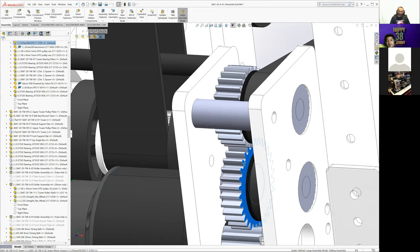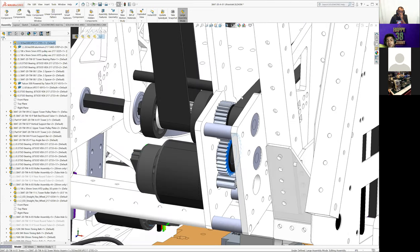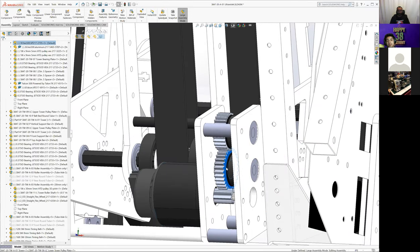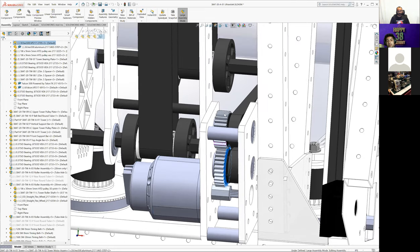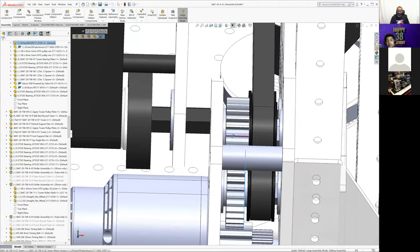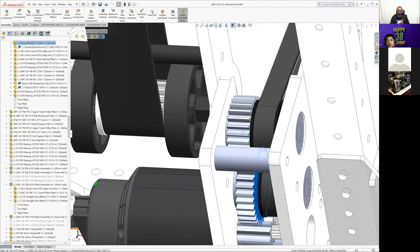But it ended up working, but it is a little odd and probably not ideal that our front belt is going faster than our back, right? Yes. Right, because our back belt is 8 to 30 and our front belt is 8 to 28, or 26. So the balls are spinning a little bit as they go up, which may be causing some jam issues, right? If you have two balls touching and they are trying to spin, they don't like that. So that is definitely something we would fix and probably would have even fixed in season as we made the next iterations of our tower and things.